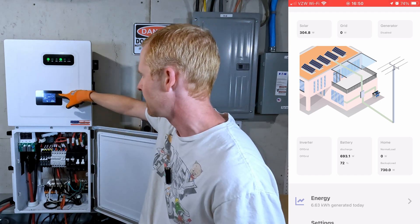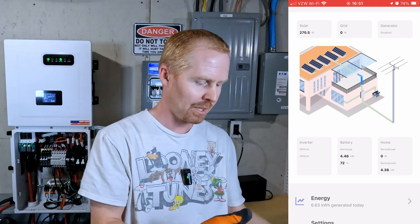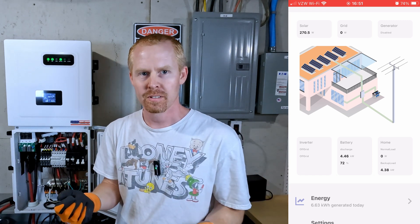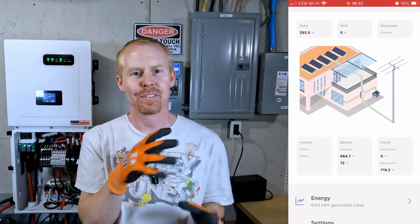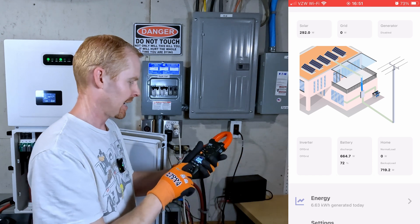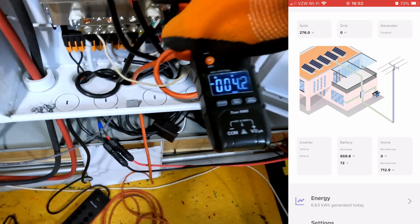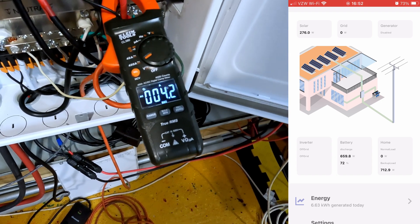We did have a little indicator flash on the screen for a second — I don't actually know what it was. We don't have any grid connected, and on the mobile device we show 4.3 kilowatts of load. Let's turn those off because they're loud. So two two-horse motors firing up at the exact same time — that's quite a bit of power. I wonder if I can get the clamp meter on this. I don't have an inrush meter; those are expensive. I have my clamp meter set to maximum — it's not going to capture the full inrush but it gets pretty close. I've got the clamp meter around both lines to hopefully get the maximum draw. Right now the max is 4.2 amps.